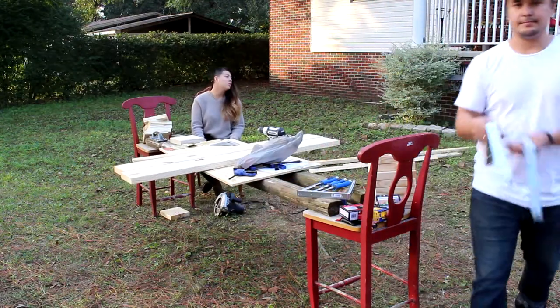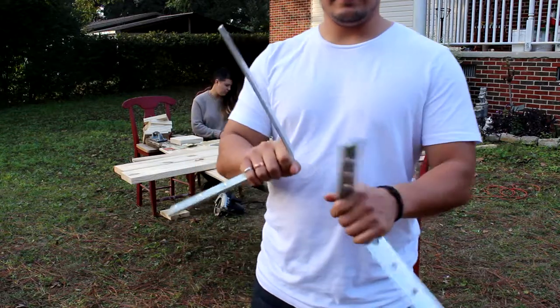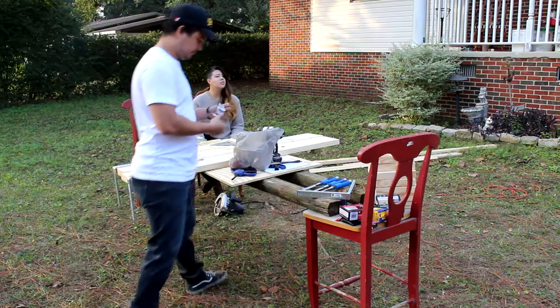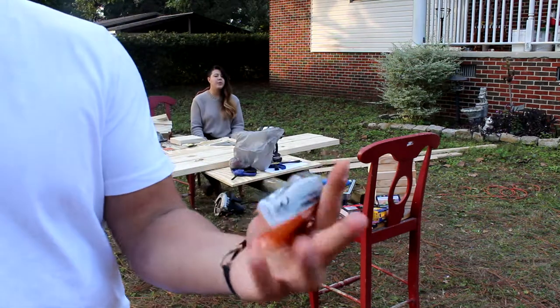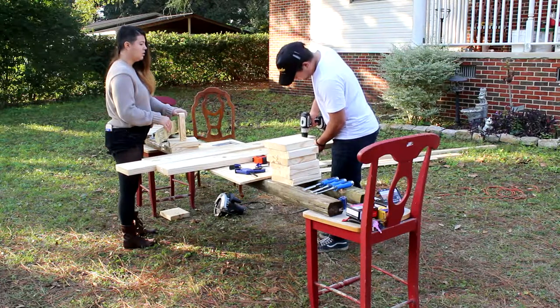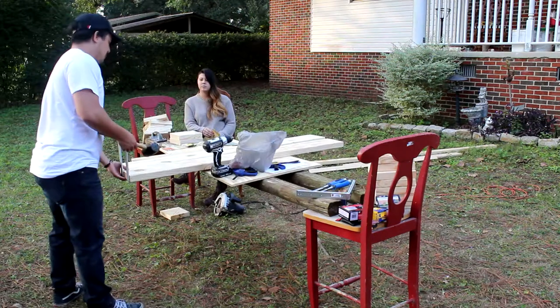I'm not an experienced carpenter by any means, so I wasn't gonna do box joints or dovetail joints to mate this bottom of the shelf together. For this, I just bought simple metal L brackets. They're gonna be the biggest ones you'll need for the entire build. They are 10 inch by 10 inch. I chose these for their perfect length and solid steel construction to ensure the shelf won't topple over due to a weak bottom. I fastened them on by using wood screws that mated well with the holes already pre-drilled into the bracket.